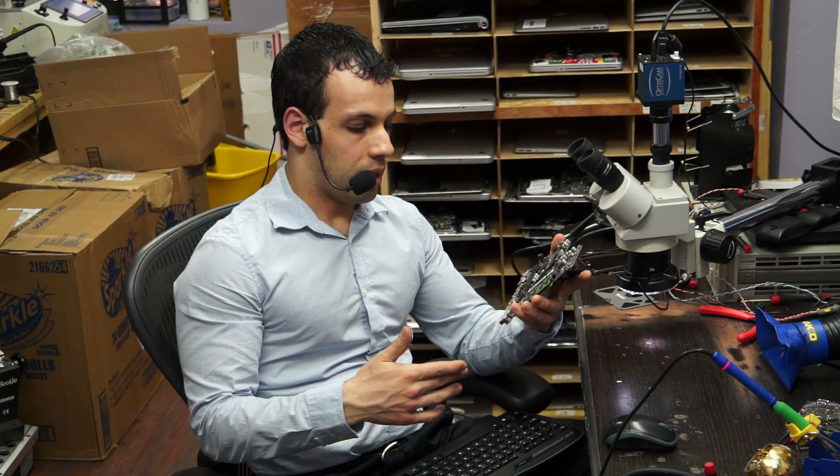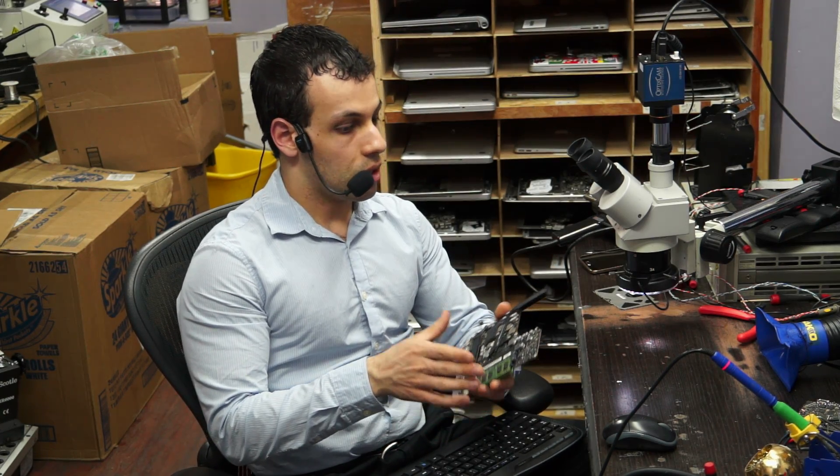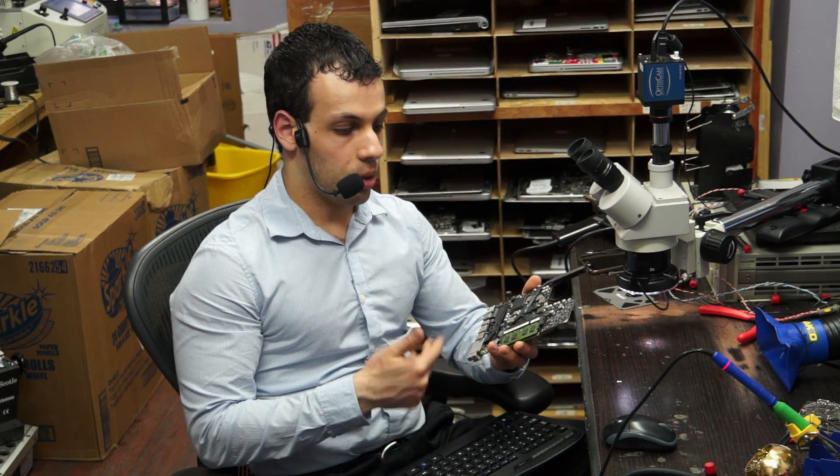So I have to start using my brain here. I don't think this person ever actually tested this board outside of the computer. When it's outside of the computer, it works. But when I start plugging things in, it dies. So I plug in each individual component and try to figure out at what point does it stop working. It stops working when the trackpad is plugged in.